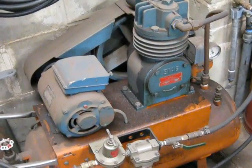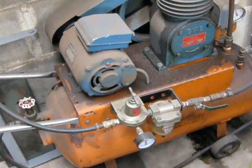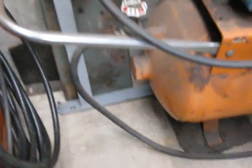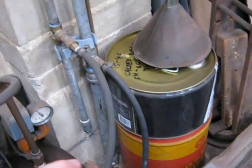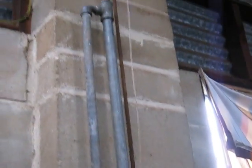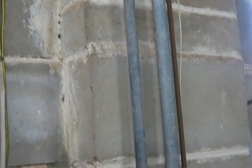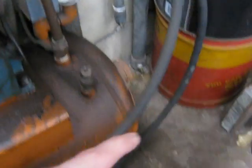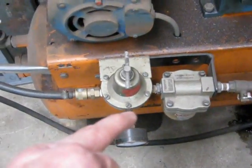Here's my air compressor — it's about seven and a half cubic foot — and you can see it's got the dryer and the regulator on the side of the tank. The actual air line that comes out of the tank goes along the floor and comes up into a big piece of water pipe, which goes up to the top of the shed, goes left in a U-turn, and comes back down in a smaller pipe. It comes down and there's a line out here that goes into your air regulator and your filter — it's a Schrader in this particular case — and then it goes to your outlet line.